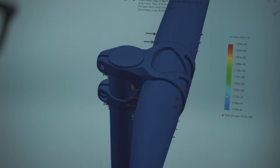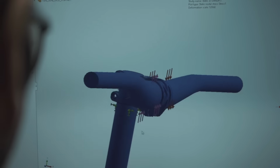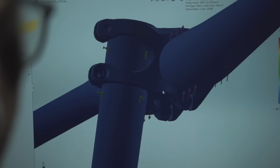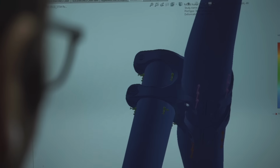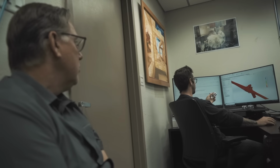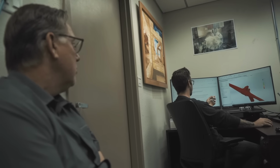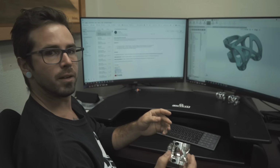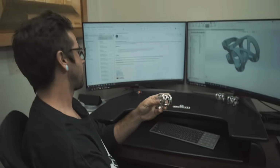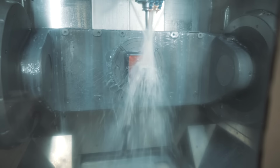As long as we don't have any of these red areas right here, we can see that we're not failing, as well as we can run these factor of safety charts, right? So all our load is well below the threshold, given that titanium has such high yield strength. Right, so we took this to a machine, a couple 5-axis operations, and have finished parts